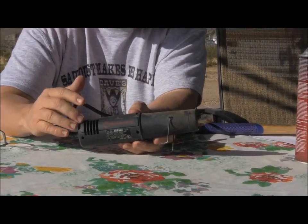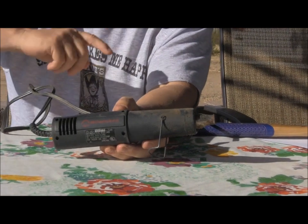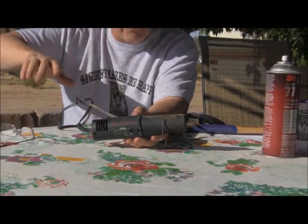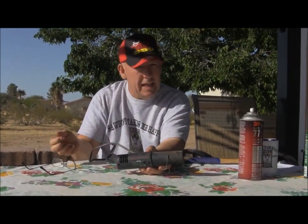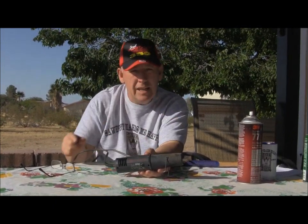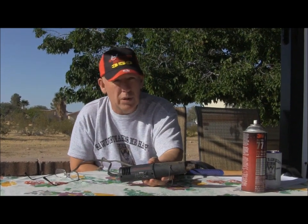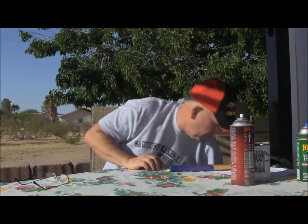I think it'll help. So what you do is before you start your sanding, to pull that paper off, after you've done your carving, start pulling that paper off and use this heat gun. And when I'm using that adhesive, most of the adhesive comes right off with the paper. So if you use a heat gun to pull that paper off, you'll hardly have to sand anything off of there at all, and that should really help. I know it worked really well for me. So hopefully that will solve your issue there, and if any of you other folks are having that issue.